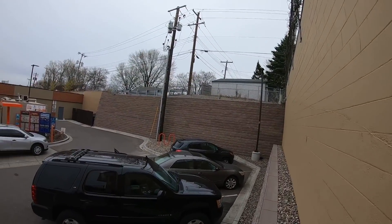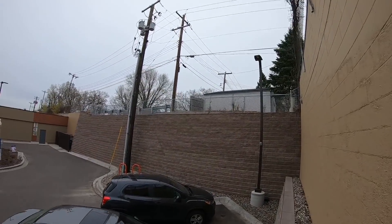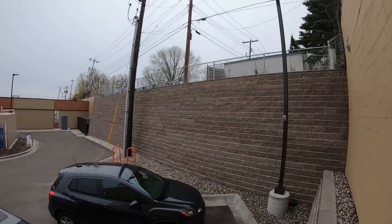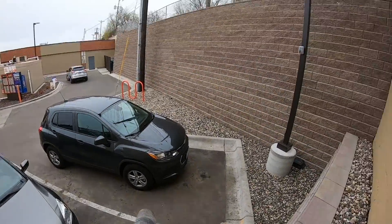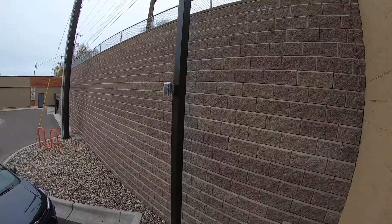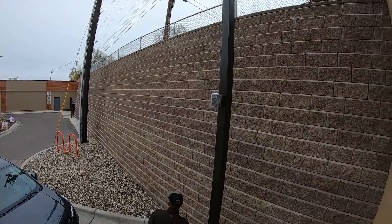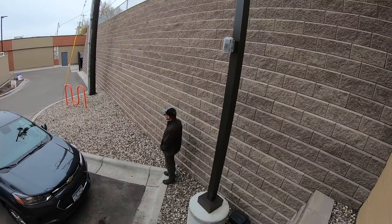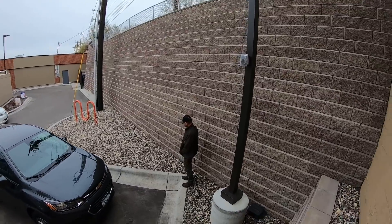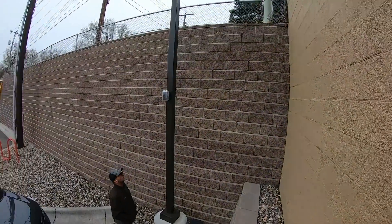When we look at this wall, do you see anything that would prevent getting the right amount of grid in — like a garage that was obviously never moved? The telephone pole may have been moved, but that garage wasn't. So to get this wall in place, 18 feet back means they sacrificed on the geogrid. Aesthetically they did a decent job, but structurally there's a question. The grid on a wall this high is more important than the block — the block actually becomes secondary. In fact, when done right, you can literally take the block off and all the soil will stay in place just from the geogrid. The block becomes almost like a facade.